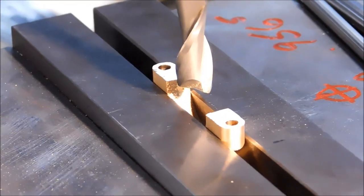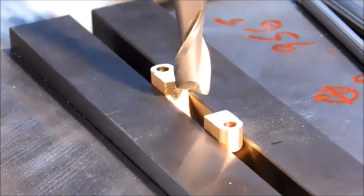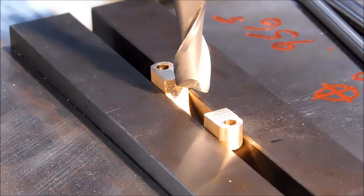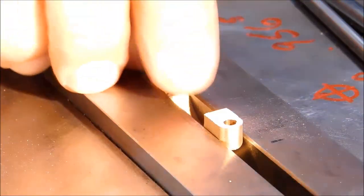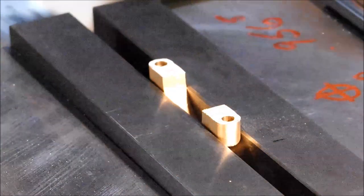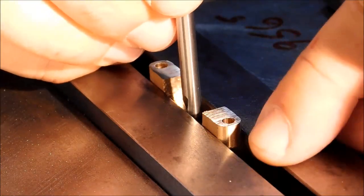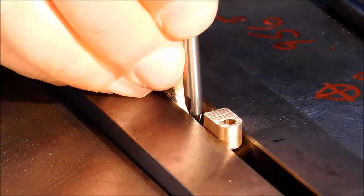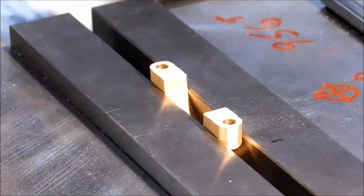First half is set. I'm going to take a dust cut, measure it, come back and finish. And by set, I mean there is a parallel in the machine. Simply drop this in, put something thinner than the part in the middle of it. That'll give you a nice rock registration. Lock it down. Now dust it.